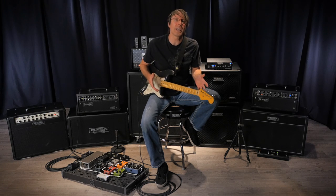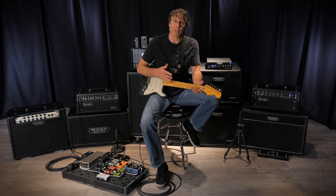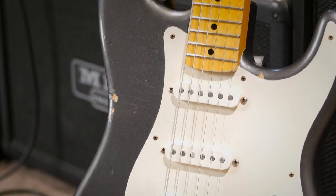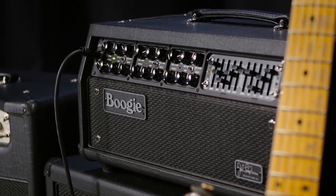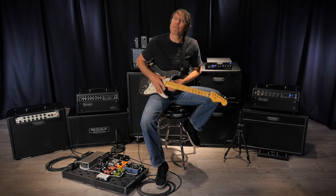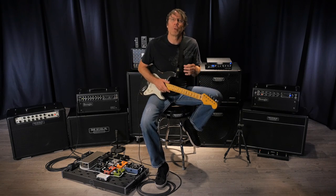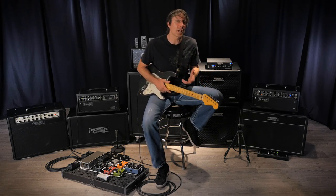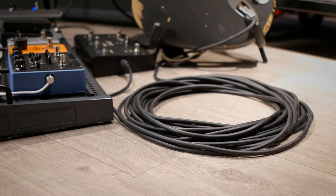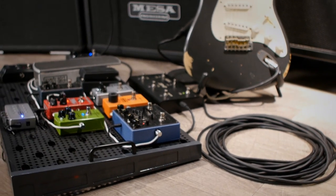But the other key advantage to buffering that we can't hear, but it's equally important, is feel. The instrument pickup and amplifier relationship is reactive. This means that the pickups are actually affected by the way the amp's input receives the pickup signal. So when pickup output and amp impedances are matched, the exchange of signal information is optimized. While the capacitance of cables that causes high-end loss also affects this loading, the primary killer of ideal pickup loading